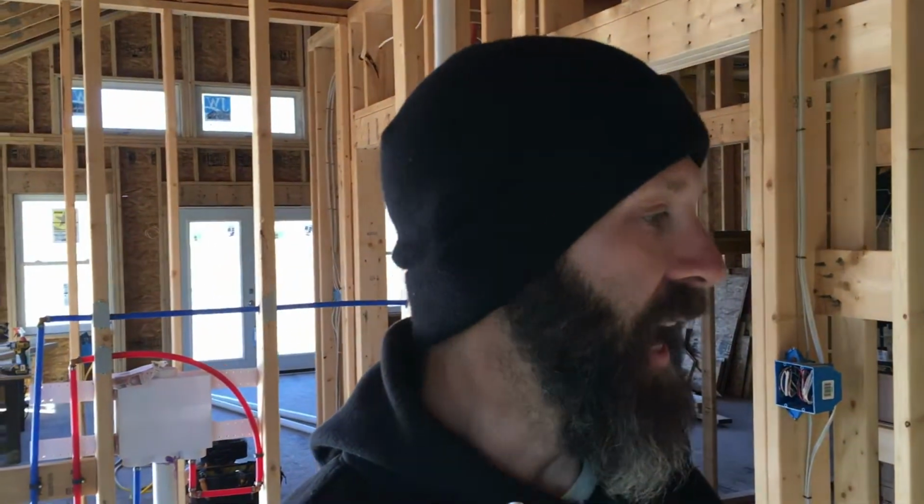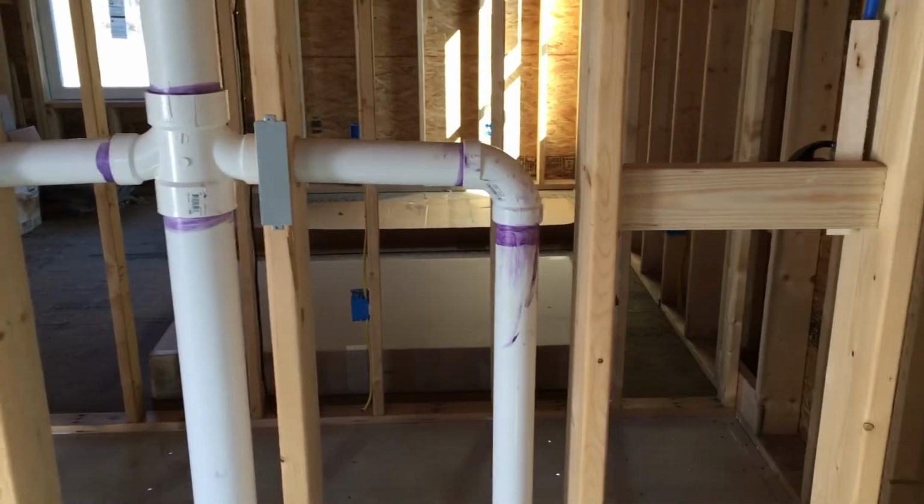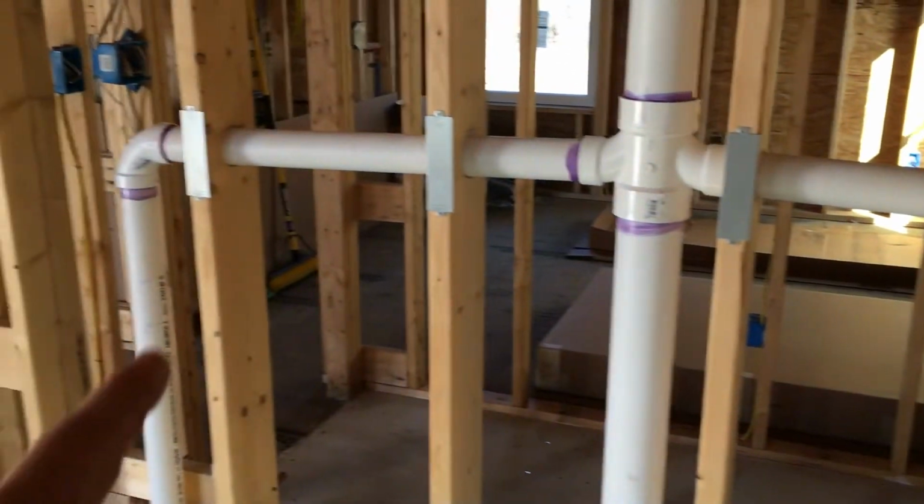I didn't think that the pressure gauge was dropping over at the kitchen sink. I mean, 5 PSI, so hard to see it moving down. So I filled it up a little more to like 7 or 10. And I did find one leak. I thought there was something real slow about it, but I did find one. It's in the vent stack, it's right there. And believe it or not, I borderline remember that being a problem.